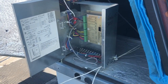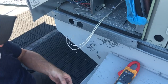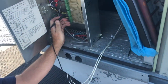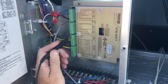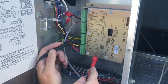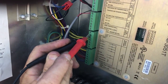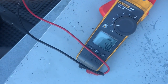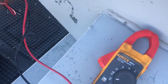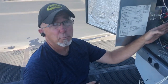NOVAR is so much easier because of how it's set up with the voltages on it. I'm gonna separate these cables and set them aside, then take my meter set to DC volts. I'll put my black lead on shield and check from shield to positive — terminals 15, 16, and 17. You can see we've got 4 volts; it's supposed to be at least 2.5 volts DC. Now leaving my negative on shield and putting my positive on the negative terminal — we've got 4 volts again. You want 2.5 volts or better DC. That tells me this board is good on the communication side.